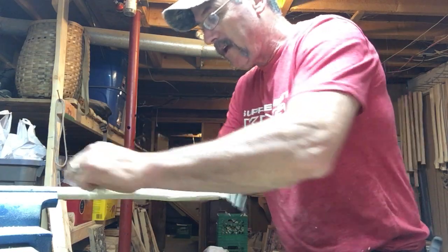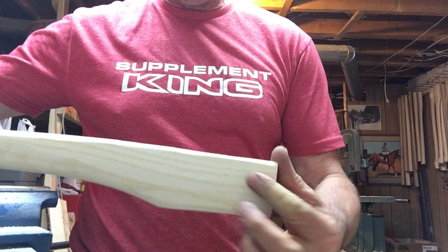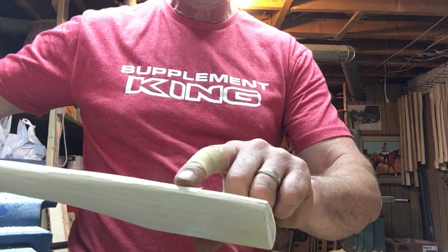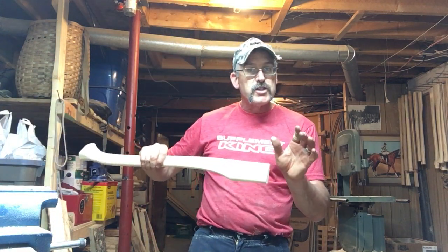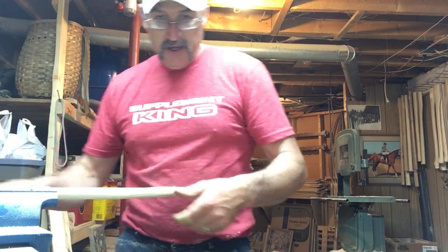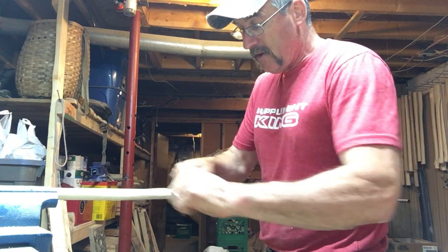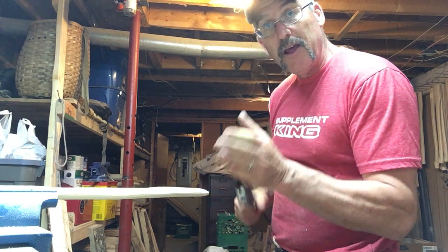I'm going to put it back in. I'll start where I drew that line, because I know it has to come off on that side to tip the blade in line with my palm swell. I'm starting down the handle quite a bit so the wood comes gradually into the eye. I'll take a little bit off the front of the eye — remember where it was curling up. And then a little bit on the back where it's starting to curl up. I took off that curl there and I took off the curl in the back.